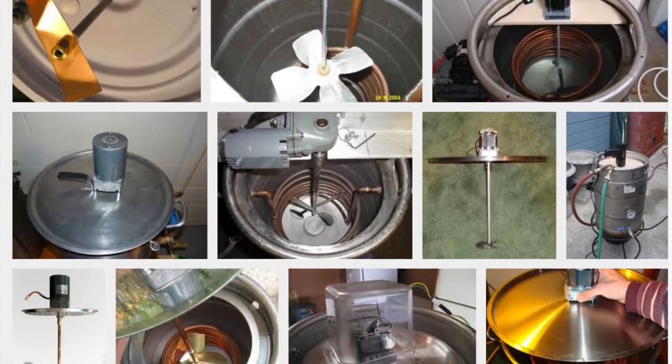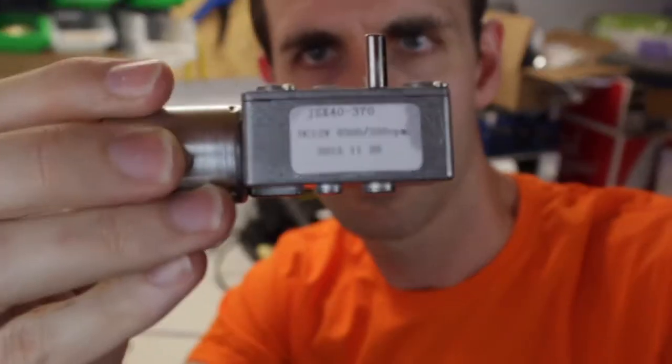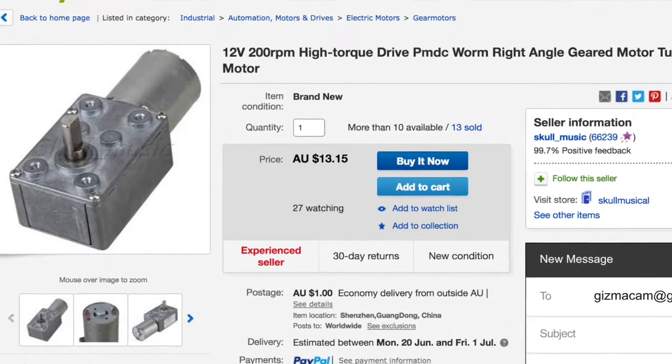There are a lot of designs out there but this video is about how I've built mine. All the parts have arrived now so I'm going to be putting it together this afternoon. Let's get started. First of all I want to show you all of the parts I'm going to use for this build, and we'll start with the motor and gearbox combination. So here's my motor and gearbox together here. It says it's 12V and 200RPM. I think 200RPM is going to be good because that means it's spinning around about three times a second, and that's going to be quick enough that it gets some movement in there without spraying and splashing stuff around.